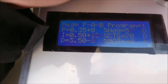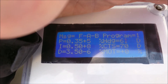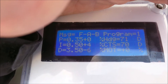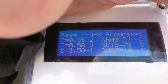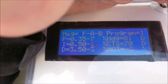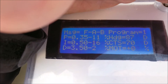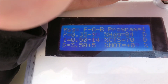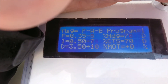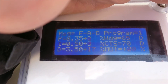It's got to the stage now where I am quite happy with the performance of this autopilot. We can kind of see it's drifted off a little bit, but it is coming back now — 58 degrees, 59 degrees. I've updated the display so that the integral term and the contributions of the three factors are listed so you can actually analyze it later and see what it's doing. I've probably got that differential term a bit too low at the moment and that's why it's overshot there, but it is coming back. Every time I try to make a film about it, something goes way off. I suspect what I've done is under-set the differential term. I'll just reset that, maybe drop the integral a bit and everything should be fine.